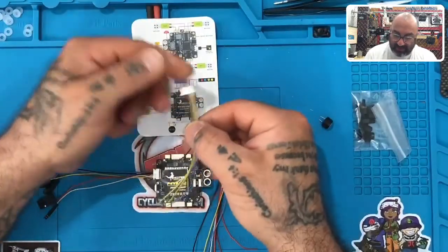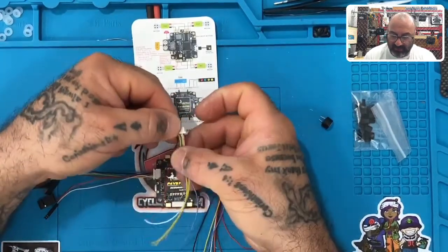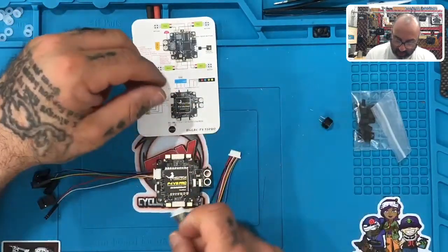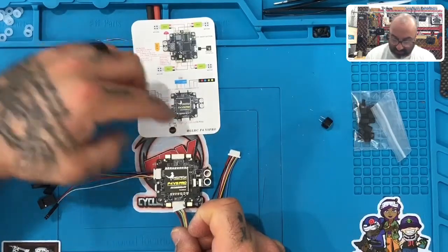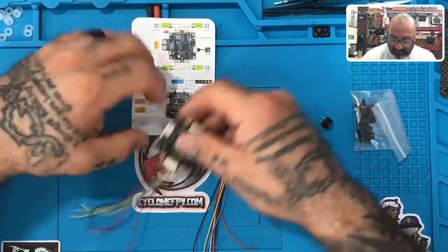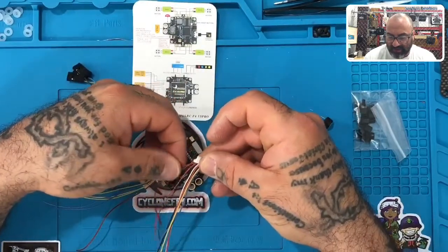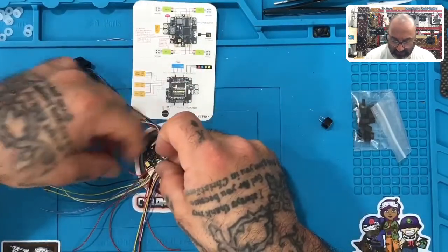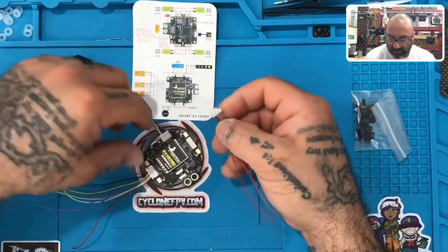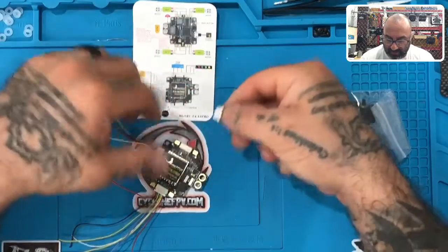The plug that has red and black - so the color sequence is red, black, blue, yellow, blue, yellow, white, red - that plug is going to go where the buzzer wiring is. You can remember that because the buzzer starts with a 5-volt, and the 5-volt is a red cable. The other side has an off-orange or maroon color, along with RX1, TX1, 5-volt LED, and ground.